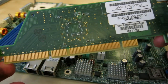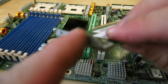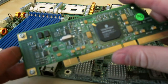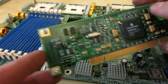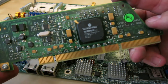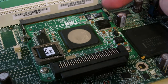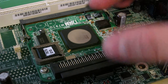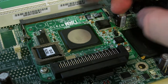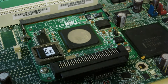Up next is the Nitrox XL NMB accelerator board. This is missing a bracket, which is a little annoying — that's just how it comes. It has a Nitrox SSL decryption processor and some power circuitry. Nothing too interesting. Here's the SCSI card — it's actually installed in a mini-PCI slot, so I think I'm going to take it out and see if it will operate in another board. I don't really have any SCSI controllers, so this would be kind of useful. This is the M7970 — looks like a basic controller card, nothing too special.